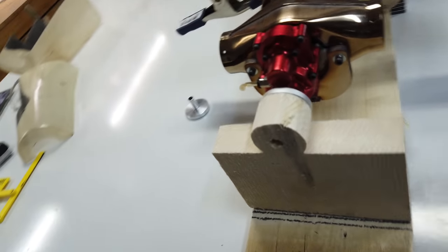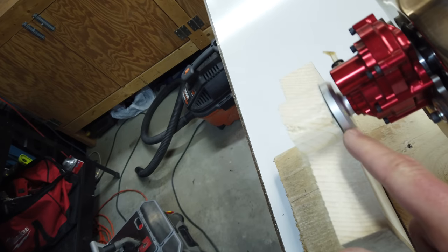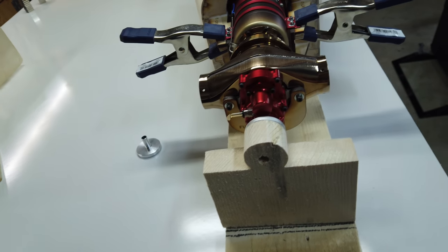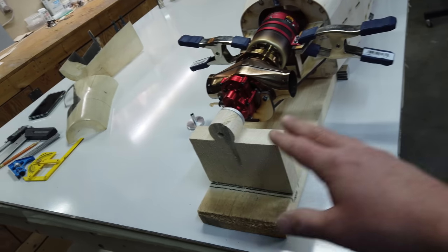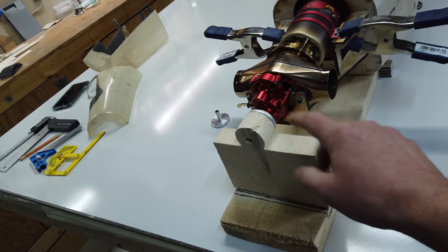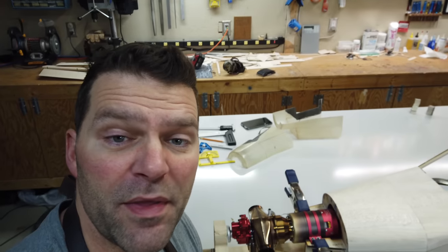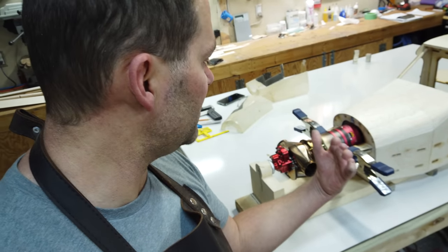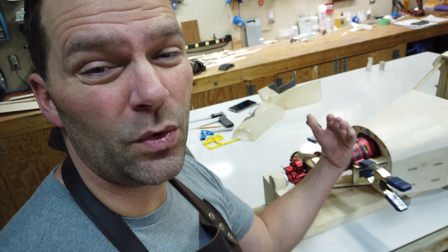With that piece of wood I traced out the back plate and cut it out, giving me a repeatable location for the turbine end. Now I can remove the engine and still have a reference template for the whole end of the engine — without that you basically can't set up the cowl properly. This cowl doesn't slide over the fuselage like a normal setup; it butts into the firewall, so positioning is critical.